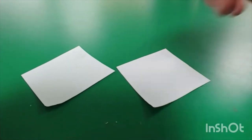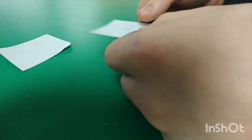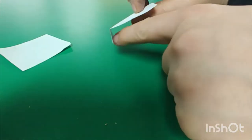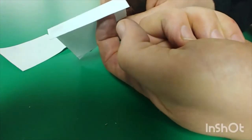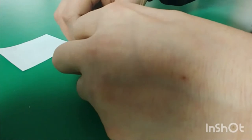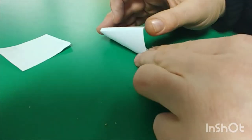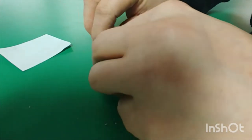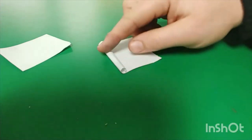All right, so when we're rolling these edges that we're gonna be working on, a lot of the videos you'll find online show that the process of rolling is to flip your piece upside down, hammer a 45 degree angle down on the side of the vise, and then put it on like a chisel or a stake and basically roll it back. The whole point is to roll it back away from your skin. This leaves a nice soft inside against where it's going to touch your body. So you hammer it flat, you hammer it down, you roll it backwards. That is a lot of times the easiest way to roll armor.